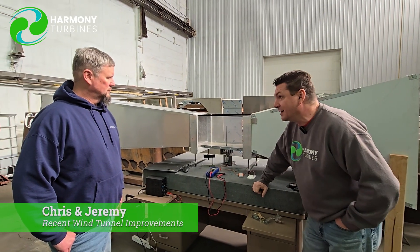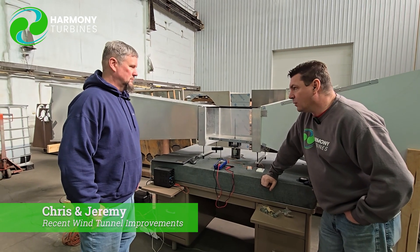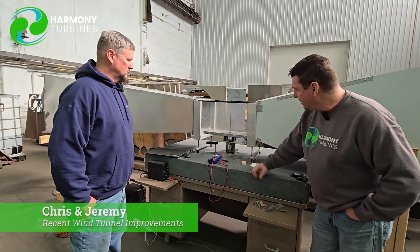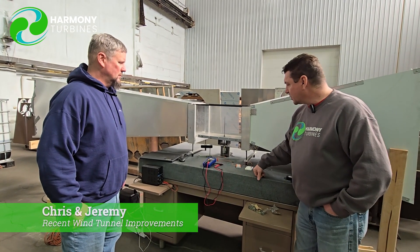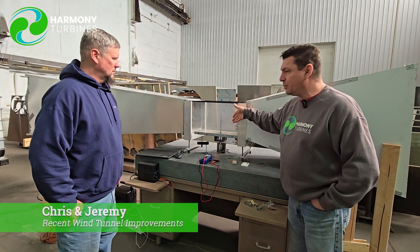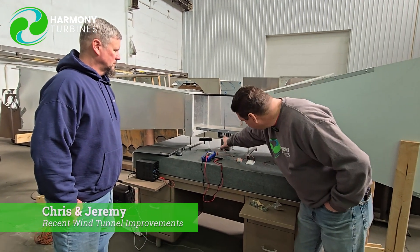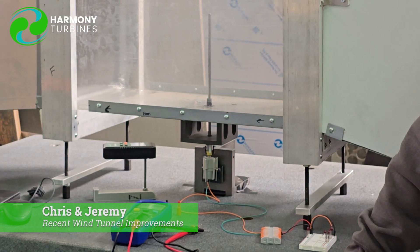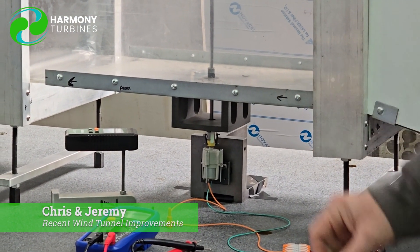One of the other things Jeremy and I were brainstorming on for probably at least a week was working on different things trying to get a good coupling between the motor and the shaft, because the shafts aren't perfect — they're not precision ground. They have a little bit of runout in them, and that's exacerbated when you put it in and start spinning it at thousands of RPMs. The coupler between the shaft and the motor is a critical piece, but how do you get a good coupling on something so miniature?